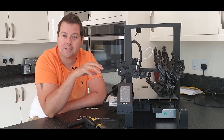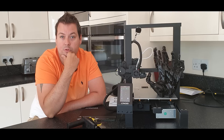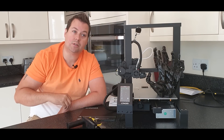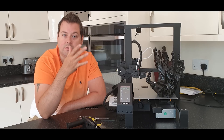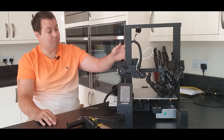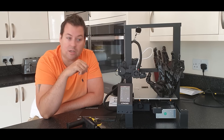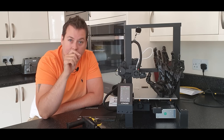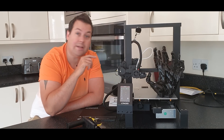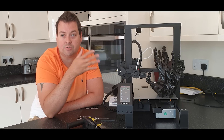The bed says it's a fast-heating DC plate — it's not a silicone plate, but it heats up quick enough. There are 2208 drivers, so it's nice and quiet, although I think they're running in standalone mode, so you won't be enabling stealth chop and sensorless homing. They have an all-metal extruder head on the back, which is pretty standard now. It's also got a filament runout sensor that is optical, not physical — similar to the one on a Prusa — and they actually give you a spare as well.